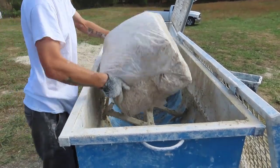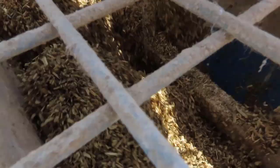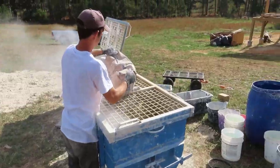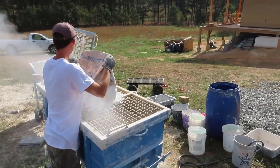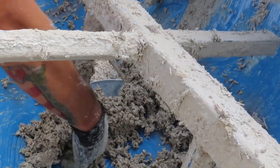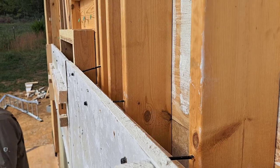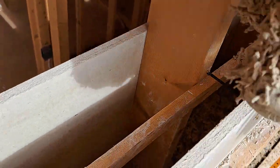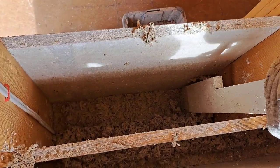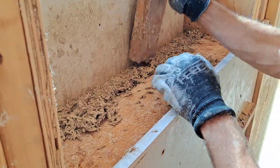The process goes like this. Dump in your dried hemp fiber, pre-mix to get any extra debris out, add in a treated volcanic ash as a catalyst, add water, get the perfect consistency, frame up the walls. You've got to leave the space in between to drop the moistened hemp fiber making the mold. Once in, tamp — layer by layer, moving on up. Remember the windows.